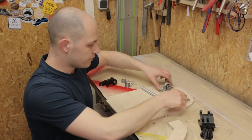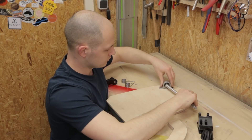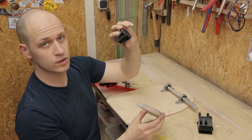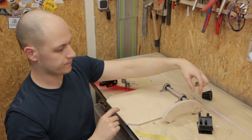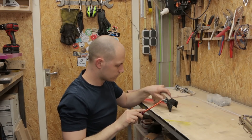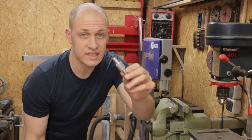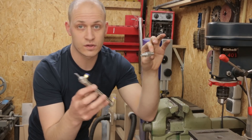So this is the plan: the bearings will come over here and the axle will go through there like this. They will sit roughly over here. The arm is mounted on this hexagon piece with this 3D printed piece, and I'm using this 3D printed piece to give it some more strength. It will be like this over here with the 3D print over here. This little piece is the connecting piece for the cylinder to the axle for the arm, and the cylinder is there for the damping mechanism.